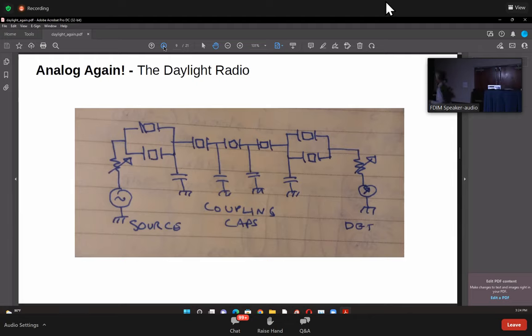Now you would ask, okay, if the ripple is controlled by the resistors, why don't I just use the lowest resistance and be done with it? Now the problem with that is, as the ripple goes away from inside the crystal filter's bandwidth, the skirt, from being vertical, starts coming up. So as the ripple goes down, the skirt broadens, right? So you want less ripple, and then you get a brick filter. So that's what the trade-off there is.